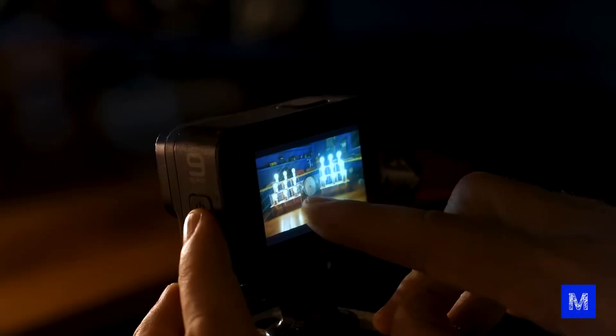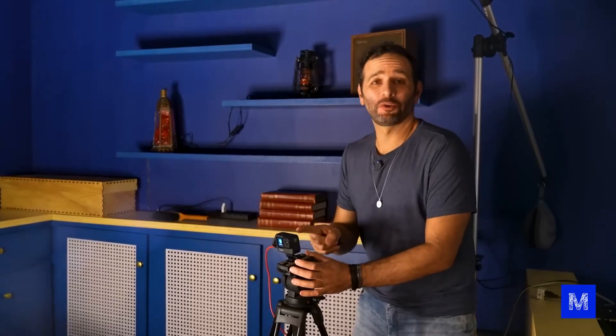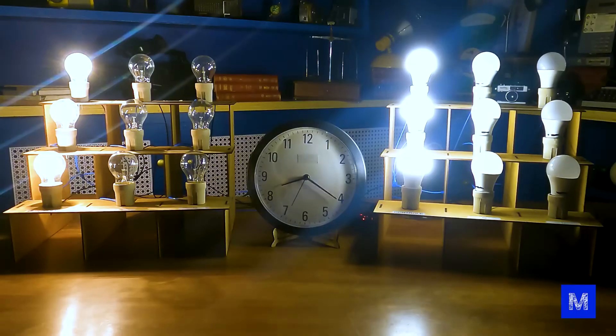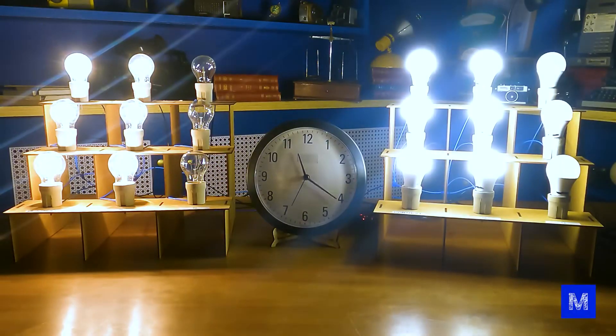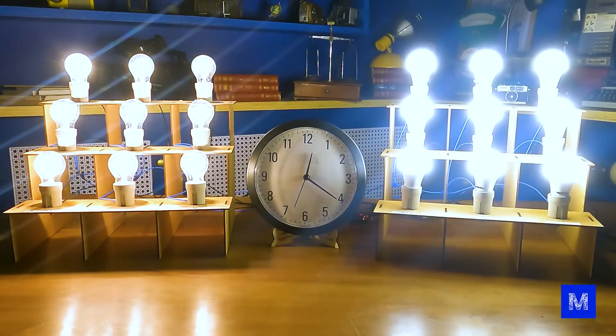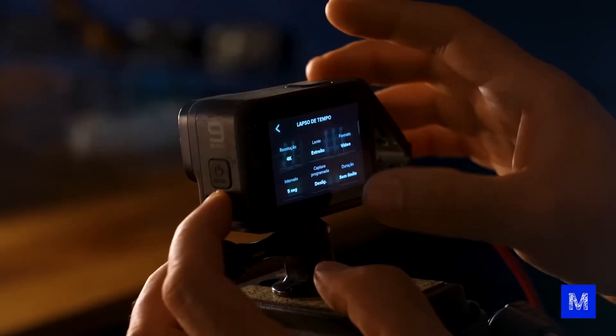Let's fix this since we got lucky this time. Sometimes it's on, sometimes it's off. Watching the time lapse is really crazy — you can see the light stays on for a while, then it's off for a while and the clock is spinning like crazy. Because of a lack of synchronization between the Arduino's internal clock and the camera's internal clock the light doesn't always stay in the same position — it alternates. Let's set it to five seconds so this won't happen anymore.